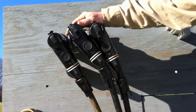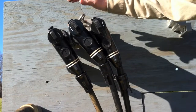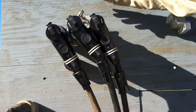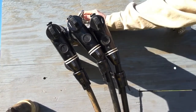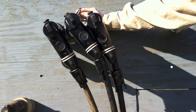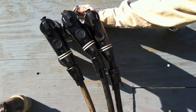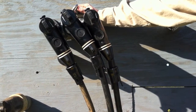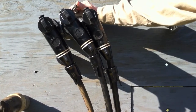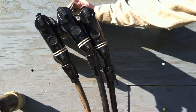Another part to this is for a 3-phase transformer, and I apologize I don't have a good setup scenario, but I can tell you how it's going to work. Right now, if you've got a 3-phase pot, you've got 3 bushings in there, and if you want to add another transformer, these are for industry customers with primary metering. If you're going to tie in all that, you've got to change the transformer out, and that's about $28,000 to $30,000 for a new transformer. This way you can make your old transformer work. Also, with that 4-way, the same way, it gives you lightning arrestor protection too on your transformer systems.